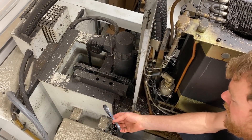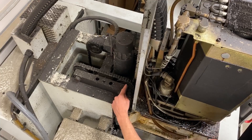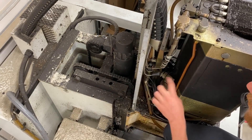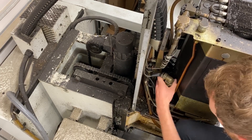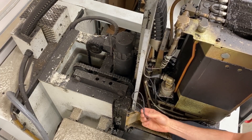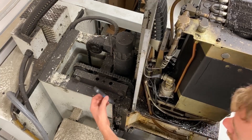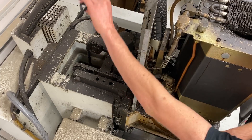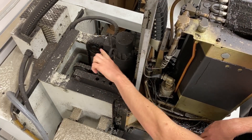We're hanging out up here on top of this machine. This machine is old enough that it had a chain and weight counterbalance. You're gonna want to look at the sprockets — make sure they aren't all worn out, that the chains aren't broken and hanging by just one chain. Look inside and see how much chip buildup you have. You're also gonna want to look at the encoder, the pulleys, and the belts. Be careful — don't pull this off and then try to do a tool change; you're gonna need to reset orientation. Check the condition of the pulleys, belts, and chains. Also look at this cable track and make sure it's not shot. Everything should be cleaned, including the nastiness over the regen resistors.